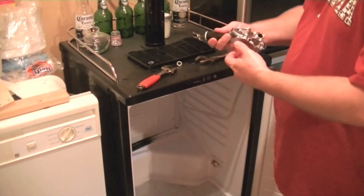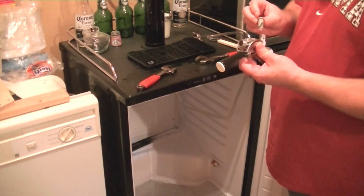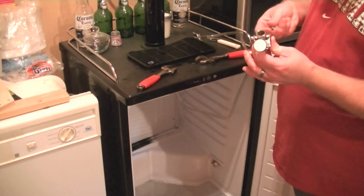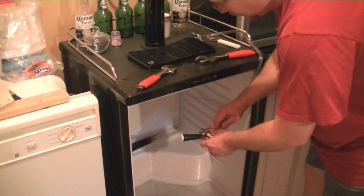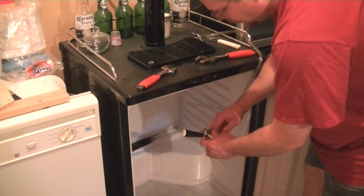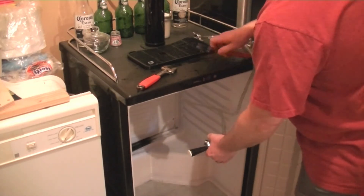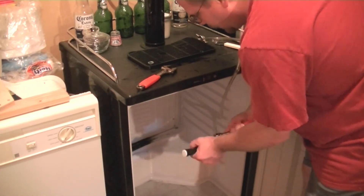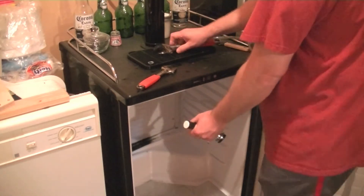I have the coupler here. I'm going to take this silver or gray grommet — it goes for the CO2. Make sure that's clean and put it in, then screw our nut on. Previously I didn't show the part where I loosen the nut, but usually tighten these down with a crescent wrench just to make sure it doesn't leak. I've had it leak before — you can only turn it so far by hand, but you need a wrench to snug it all the way.